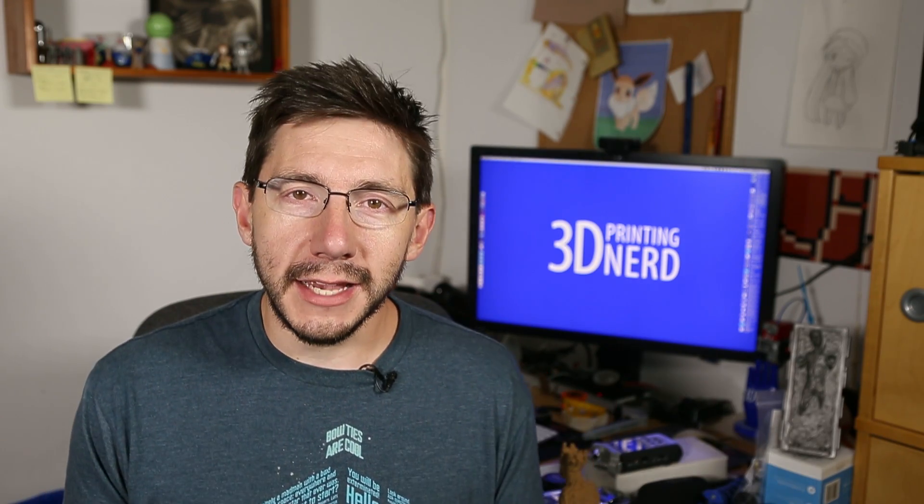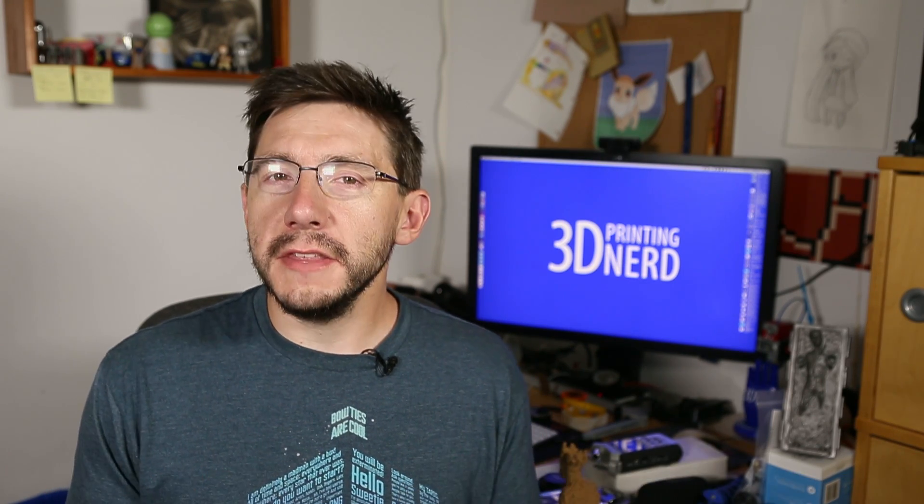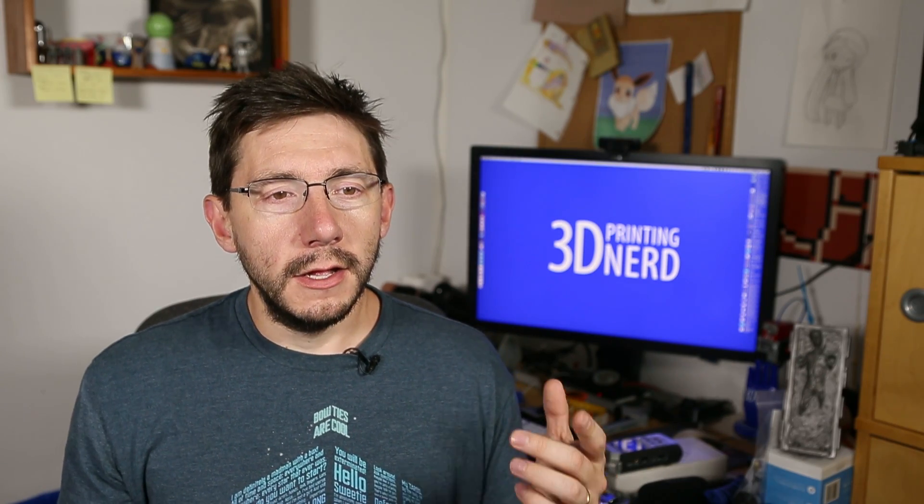The printer's working — we've successfully come back from the dead and repaired the printer and it works gloriously well. I'm continually impressed with this Raise3D N2 Plus. In hindsight, it was my own stupidity that caused this issue. I could have done things differently: instead of taking it all apart, maybe I could have just pulled the fan, heated it up to 240, let the heat creep up, and possibly got the clog out that way. When reassembling, I could take the nozzle off, put the throat tube in first, and then tighten down the nozzle against that — probably a better idea.